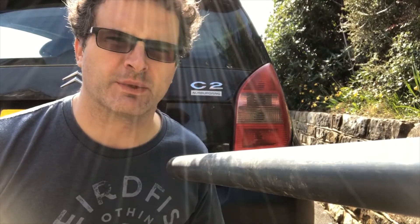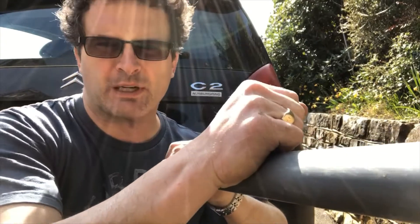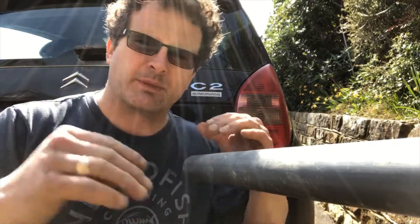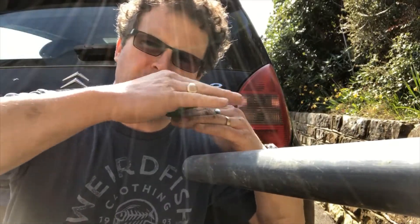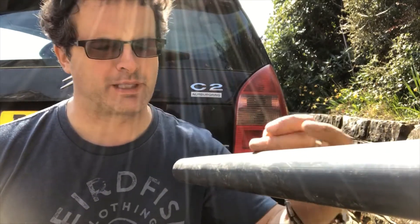I've just been having a look at the duct and where it's got to go. This duct is quite rigid — it doesn't really bend unless it's over a very long distance. As this comes down through the garden it has to then go through the wall and it has to change its direction a bit tighter than it will allow. I don't want to put a preformed bend on it because they're quite sharp, and this is supposed to be a cable duct so I want a sweeping bend. So I'm going to try and heat this and put a bend in it about 200mm from the end so it can go through the wall at the right angle.